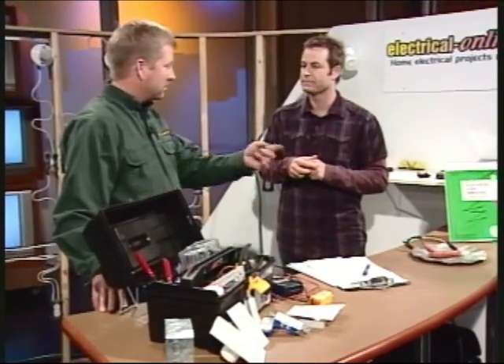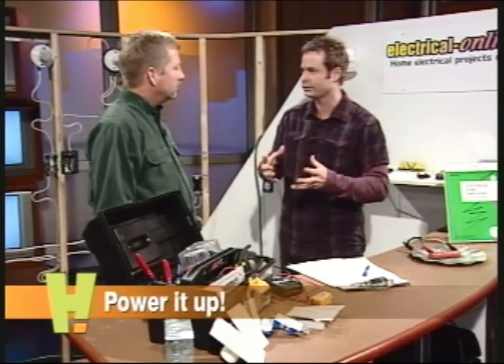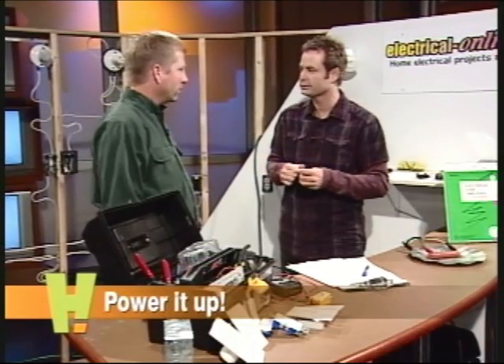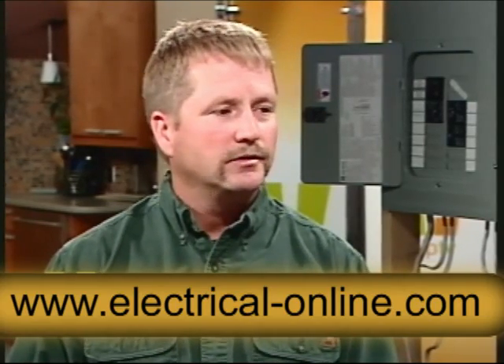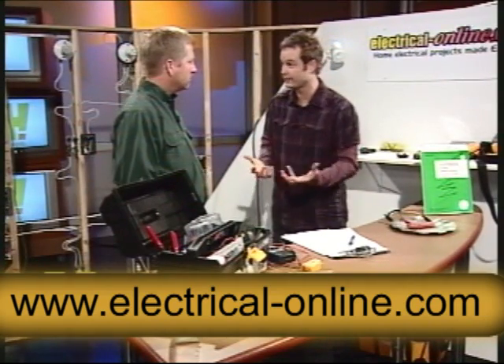Do you want to show that right away? Yeah. And I mean, this could be your finger or this could be your heart. Now, 120 volts is your standard electrical power voltage. In your home you have 120, 240 coming into the house — two legs of 120, 180 degrees out of phase of each other, so between them there's 240. Between each leg and ground or neutral is 120. The reason we're going to do this is to show that there's a lot of power in that power.